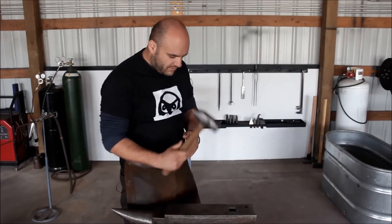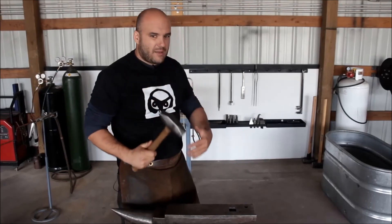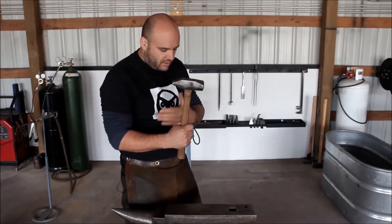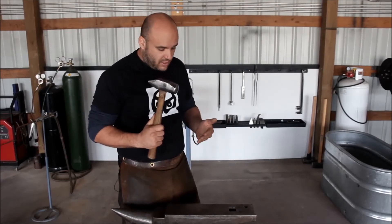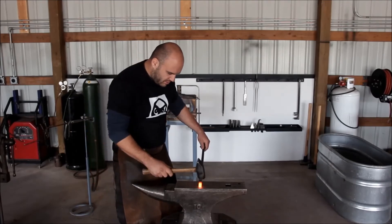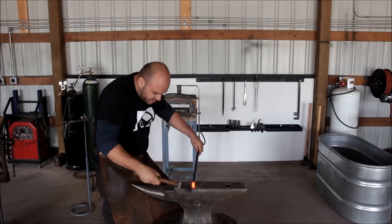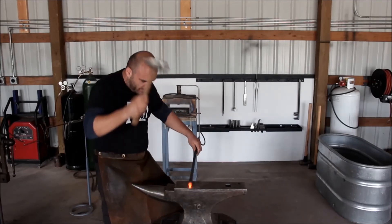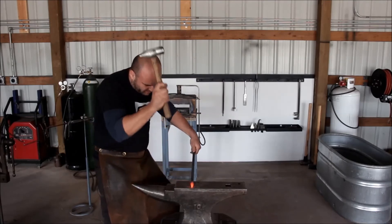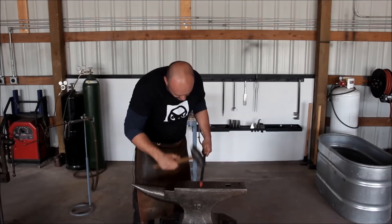When you come to forge, you simply lift up the hammer and aid the falling of the hammer with your arm and also with your whole body mechanics — it's a dynamic movement. Don't push it and don't use a dead grip that will stiffen up your wrist; the vibration will eventually hurt your elbows and wrist. With our piece of steel ready to forge, we just lift the hammer and drive it down — you can see my whole body is moving, my wrist is loose, not using force but dynamic impulse. This way all your joints are much less stressed and you actually work faster because you're using the hammer's weight.